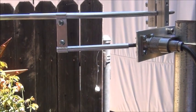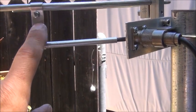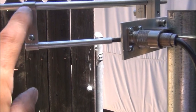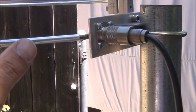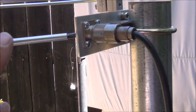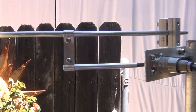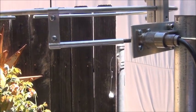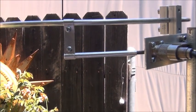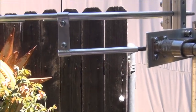As you can see, I had to adjust the gamma tube almost all the way over, meaning I needed more capacitance. The strap is actually almost in the identical location as when I started on the dipole. I think if I make a longer gamma tube and longer wire I can push this out a bit and still get the same capacitance. The problem is that once I stack two antennas I may have to adjust again, and I may not have enough adjustment range, so I'm probably going to change this gamma tube to be a little bit longer.